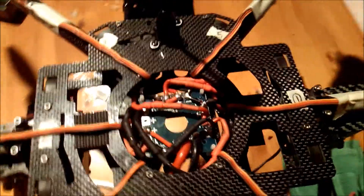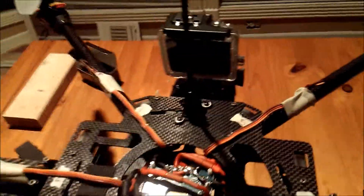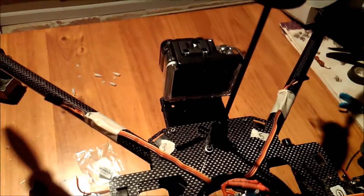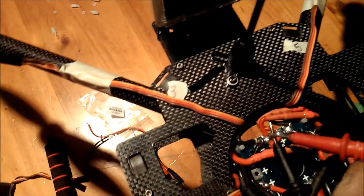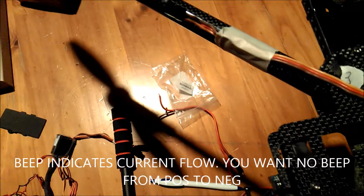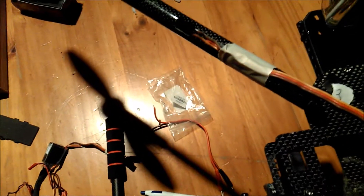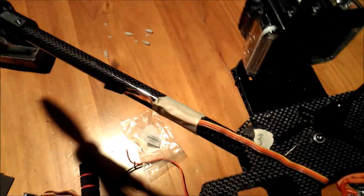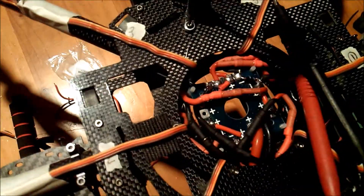You should get nothing. If you get a meter that has a built-in beep, like this one, you'll get this sound — hear that? As soon as you touch. So I'm duplicating here — negative to positive. If you touch this on negative and then go to positive, right there, you should get nothing. But if you get a beep — with black on black, red to red — if you get a beep, there is something wrong. Backtrack and double check your work.